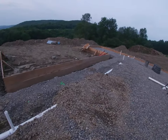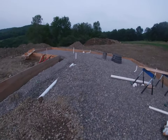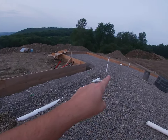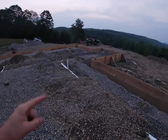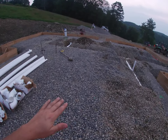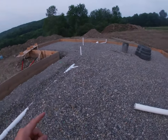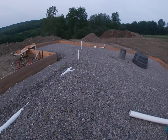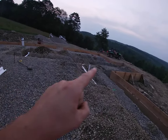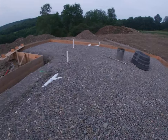A couple of tips: we started at the end and worked our way down. If you're doing an Alaskan slab, I dug the mains out where the clay is, because we're going to be deeper than six inches. Remember, six inches of stone is what we put on the rock/clay layer, so you don't want to dig rock and clay out by hand — it's an awful thing to try to do. I dug it out with the bobcat all the way down through, then I dug this main here all the way back and filled it with clean stone. I used a little bit more stone, but it was worth it.